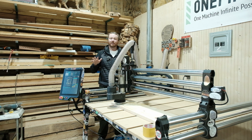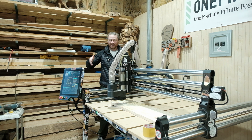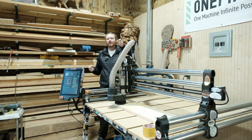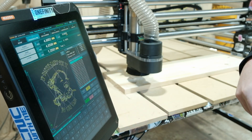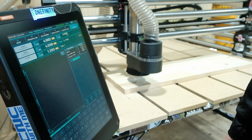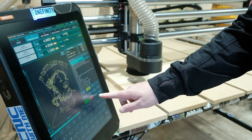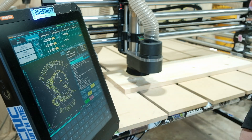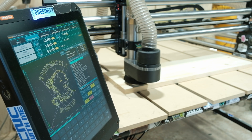I said this is going to take like two hours for a carve that I know should take like seven minutes after looking at what we're trying to accomplish. So he sent me over a brand new mystery file — the exact same thing. The really cool part is I'm not going to have to change anything about this program at all. I'm going to go ahead and stop it, load in the new file, it already knows where our X, Y, and Z zero is, and then we're just going to start it. It's going to recut the things it's already been trying to cut, but I'm not going to sit here for another hour watching this go.